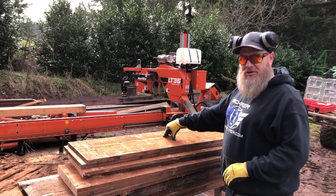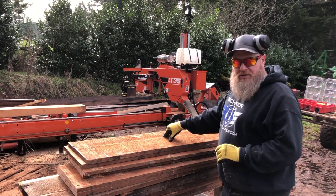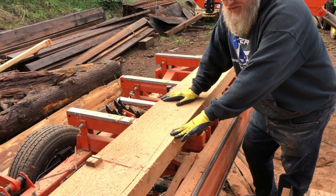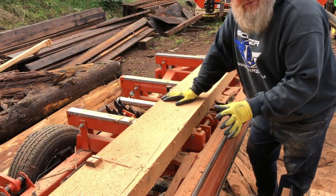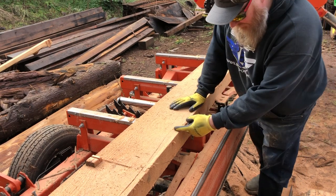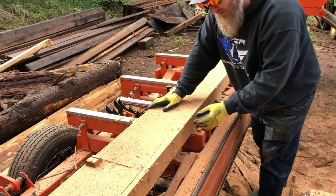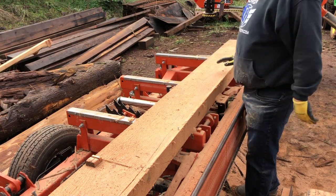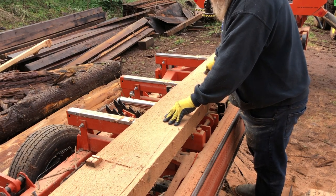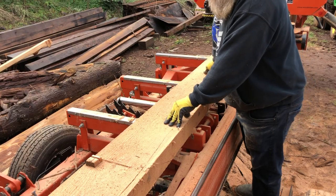I've made two more boards than I need so that I can pick and choose and get the best of the best. Now it's time to cut some plywood and build the backers these are going to mount to. Once again, this is a timber that's got a split in it. I think I was cutting it for something else, but couldn't use it. I just have two screws sticking in the edge here, sticking up half, maybe 3/4 of an inch. I've got this piece of wood as a stopper to keep the wood from trying to slide. But just these two screws and a couple toed in at the ends holds the wood in place, no problem. So if you're looking to resaw, this is a pretty handy way to do it. It's not the only way to do it, but this is the way I do it, and it worked pretty slick today.